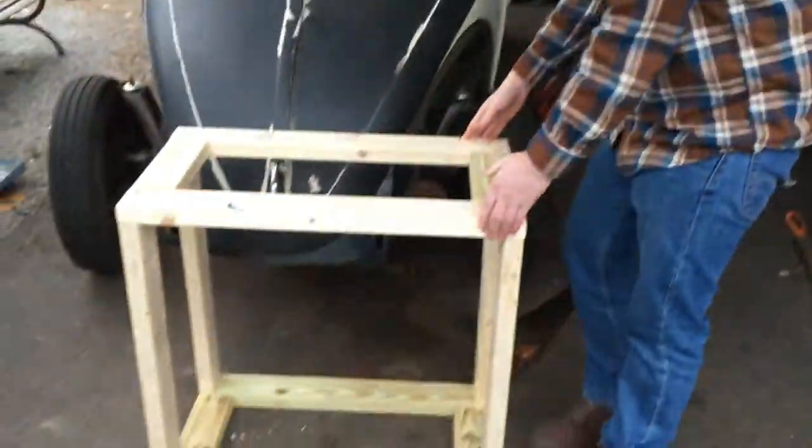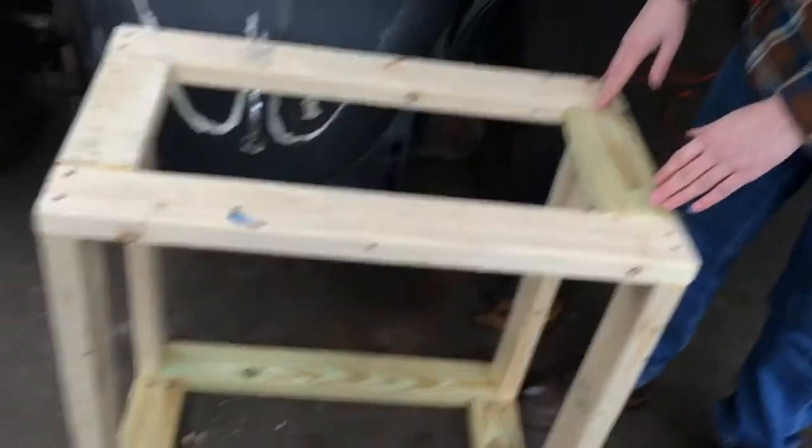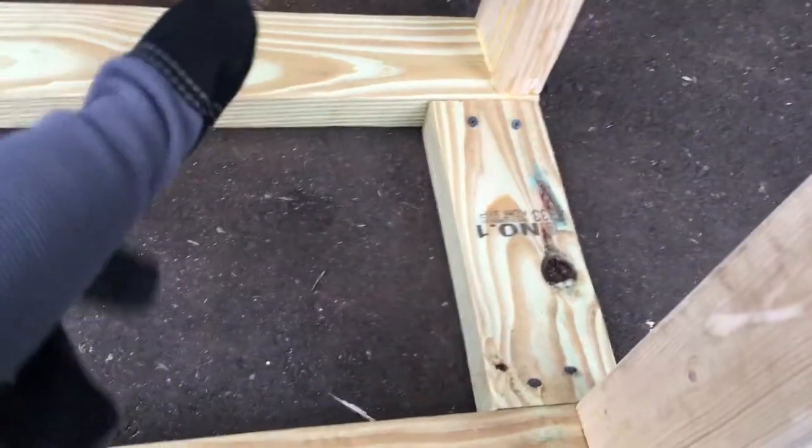So we got the thing done. We didn't show putting these in because we couldn't. These are 10-inch just two by fours to hold the structure together so it doesn't fall apart. What we did here was take two 30-inch pieces — the bottom one has to be pressure-treated because this is going to be sitting here for about four to five months. Two 30-inch pieces, one on top, one on bottom, and two 27-inch pieces. So 27 plus one-and-a-half plus another one-and-a-half equals two-and-a-half feet — so we want it to be two-and-a-half feet tall. We built this frame twice, so we have two of those.